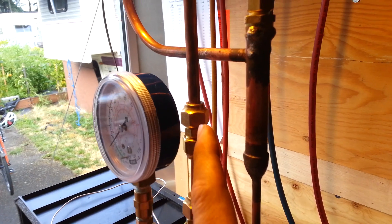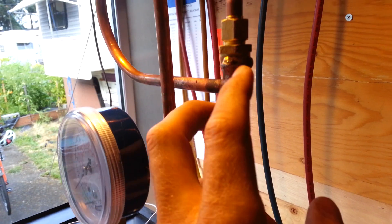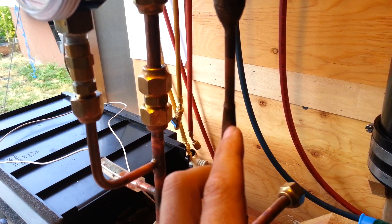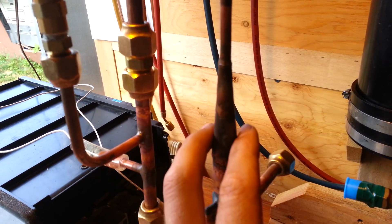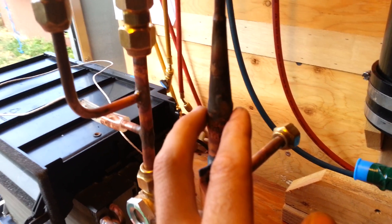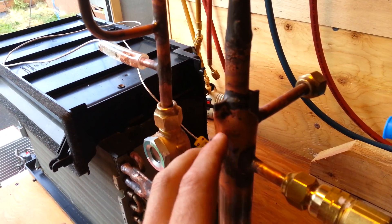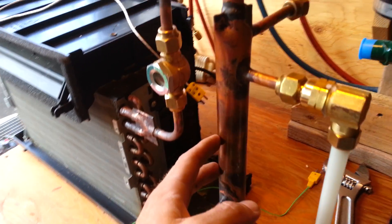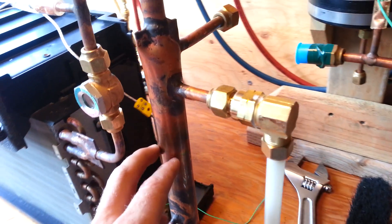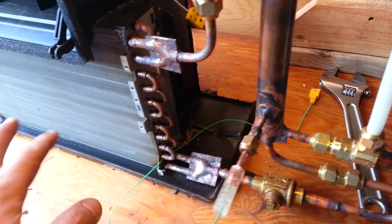The low pressure draws saturated vapor, possibly some liquid, through the inside of the half inch pipe and on the outside of the 3/8 inch pipe. The two mix in the throat, and the combination of saturated liquid-vapor increases in pressure in the divergent nozzle as the cross-sectional area increases — it slows down and the velocity is converted back into pressure. The combination then settles in the separator tank, where the liquid level is maintained around the middle, vapor is drawn off back to the compressor, and liquid goes on to do further cooling work.